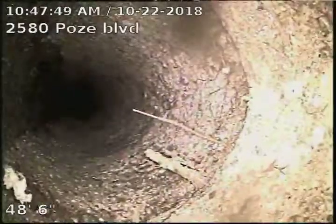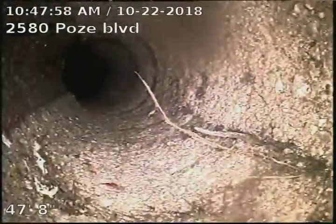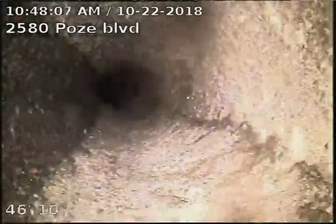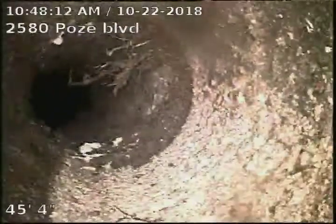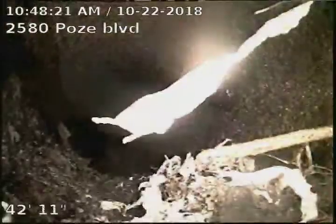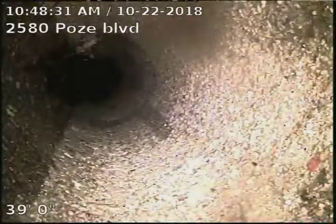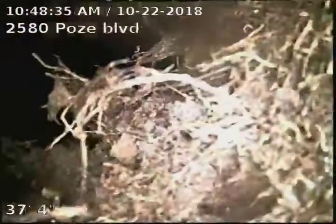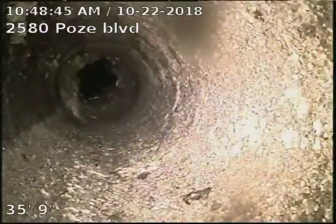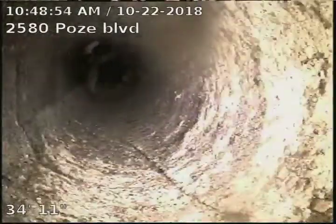There's a ring crack — you can see how that's a circular crack. There's the joint, and then there's a crack, and you can see the roots coming in there. That's a crack down the sewer line laterally, which just shows the deterioration of the sewer line. There's some roots coming in there at 45 feet. I do believe this sewer line is running to the rear of the property. More roots, and you can see the start of another one of those cracks heading down the inner pipe.